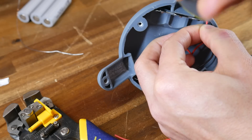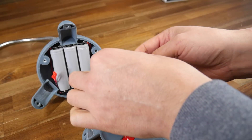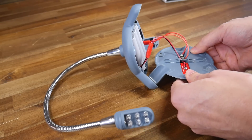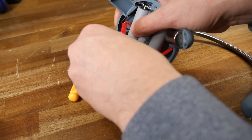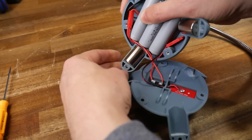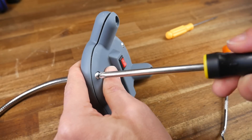I soldered on the remaining wires to the battery terminals. When crimping these plugs, I made them mismatch so it was impossible to connect the wrong ones. I plugged them both in for one last test — and when I flicked the switch underneath, the light turned on and off. With everything working, the magnets can now be inserted, and you need to do this very carefully as they're attracted to the cells and love to fly out and collide. Insert the six screws in the bottom, and assembly is complete.